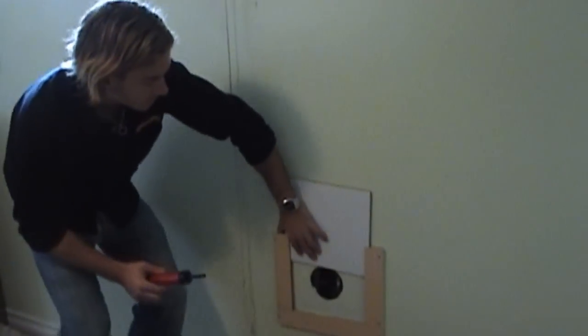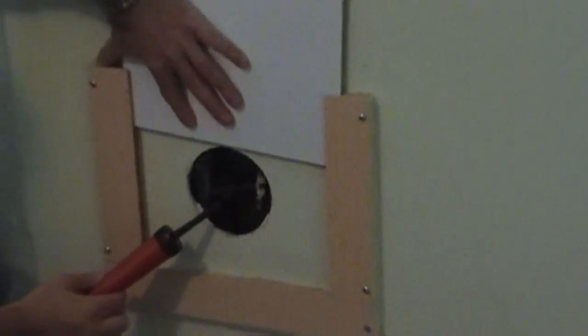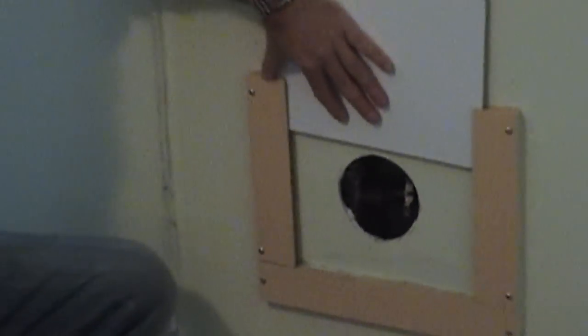This is the main water shutoff valve for inside the house — you can tell there's a lot of air leakage around here, and you can see a steady stream of smoke going out through the air leakage. Another common leakage location is valances. As you can see up here, there's leakage and the smoke clearly indicates that there's a hole.